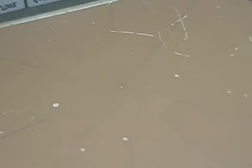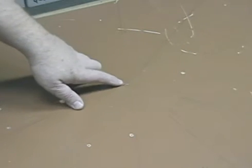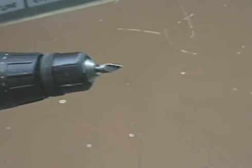Now that we've established the marks using the magnet alignment guide, we need to ensure the drill will exactly center on this point. So what we're going to do here is use a drill with a tip like this — a countersink bit — to establish that center so there's no chance the drill will walk out of the hole when you drill it.